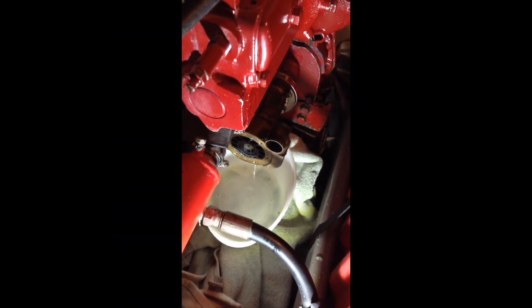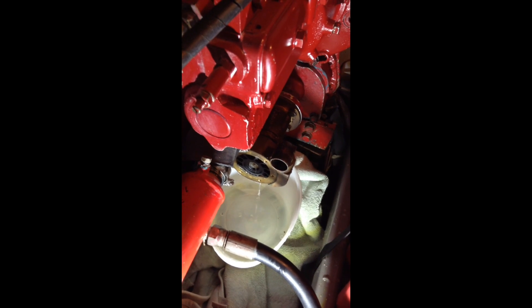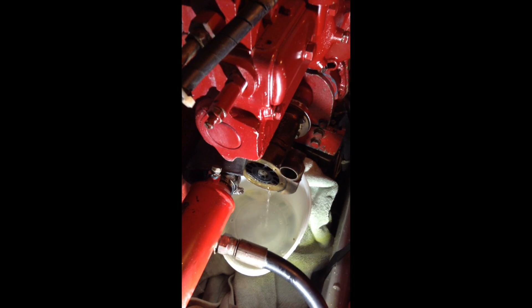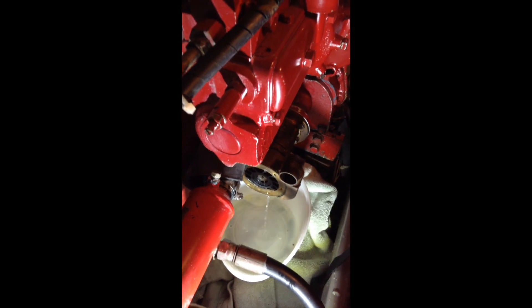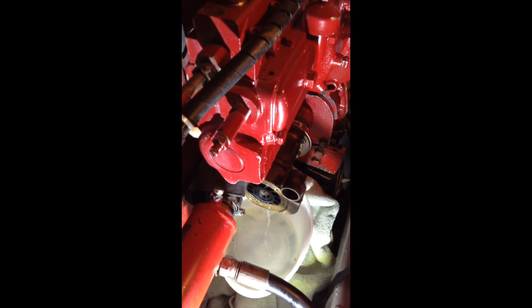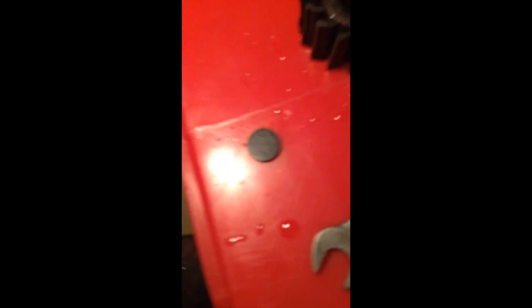Before you go to insert that new impeller blade, it's a good idea to take some silicone grease and smear it on the splines of the impeller — the metal part that goes on the splines of the pump — and also on the blades. It will make it go in a lot more easily. Once you've pushed the impeller blade back into the pump, you'll find in the kit a black rubber plug that nests right in the center of the impeller. Just install that.